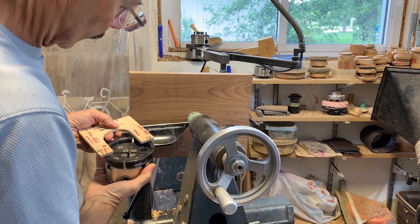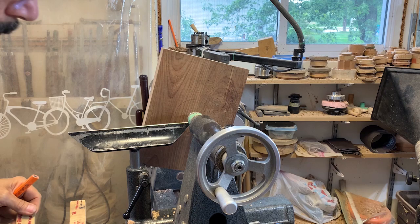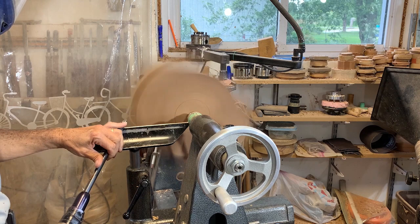I'm going to use a mortise dovetail joint for the chuck on this particular piece. That way I don't take away much material and I can retain the full thickness of the piece. You can see I've got the tailstock up for support, which is always a good thing.